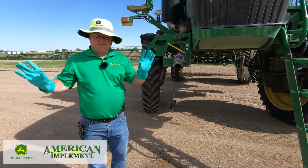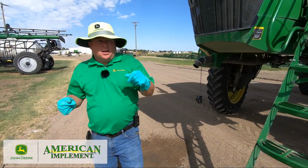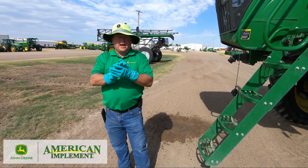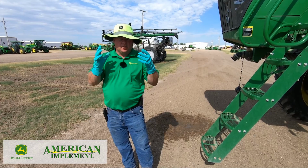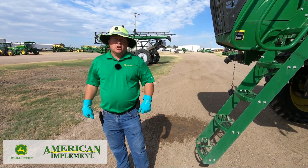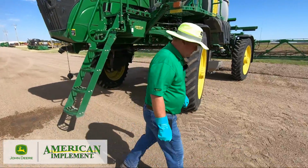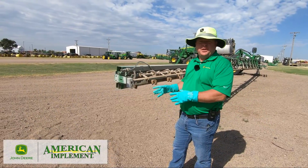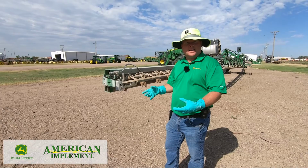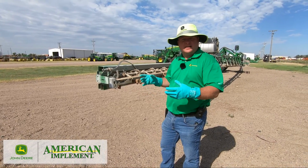Okay. So I'm clean. Now I'm up to the point where I'm about to spray, okay? One thing I like to do, because I told you before that we need to have dilution. And dilution is a lot of volume very fast to make sure we clean out our plumbing. So I'm gonna go down here to the boom and we're gonna turn nozzle bodies. This machine is set up with Exactiply. Now I would do this the exact same if I had a non-Exactiply machine, okay? I'm going to get as much volume through the boom as fast as I can.